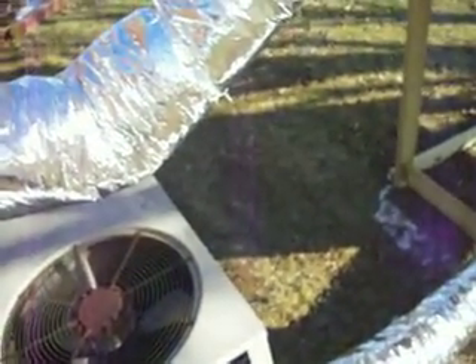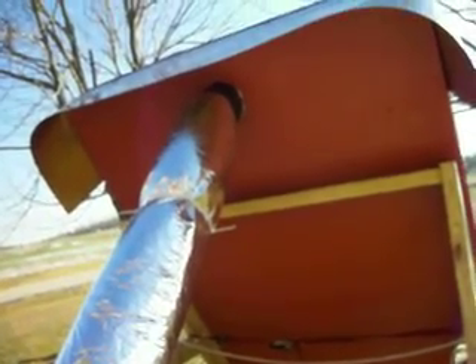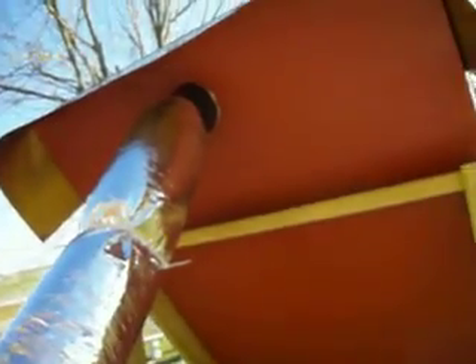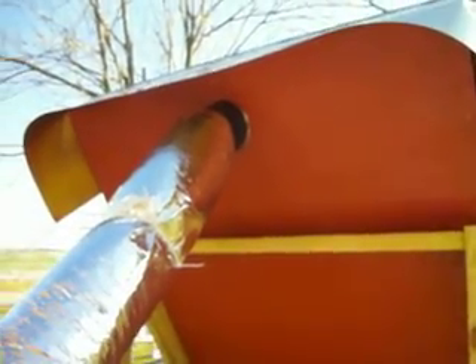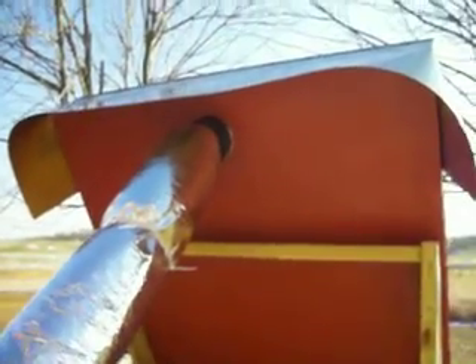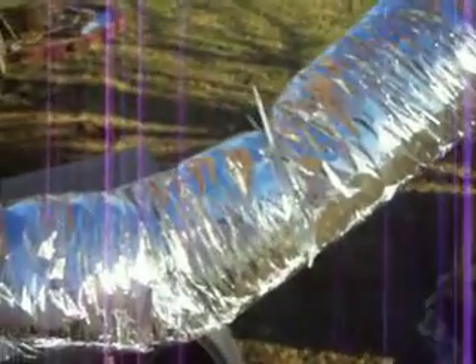Hopefully that'll take care of it. I've always got a couple more boxes of ducts so I can fix that easily. I was going to take that off and turn my snap disc down, because I do have my snap disc turned all the way up to 130 degrees to kick my motor on automatically. I think I was going to go ahead and do that about a week ago, but bad weather and I really haven't had much time. I guess it should be a good idea.